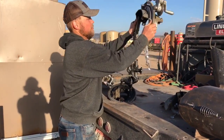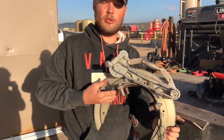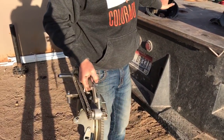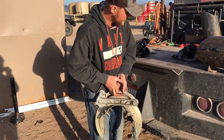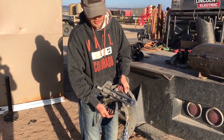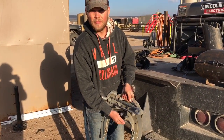Now we're going to talk about the eight-inch Matthews. The H&M eight-inch looks just like the two-inch H&M but with a longer bridge — they cut amazing. The Sawyer eight-inch looks almost the same but instead of four dogs for three different sizes of pipe, you've got four dogs for one size of pipe. I forgot to mention: when you buy a bevel machine brand new, they come with dogs — they're fully set up and ready to roll. If you buy them used, make sure they come with dogs; if not, you'll have to order them separately.